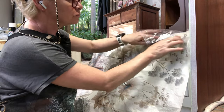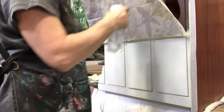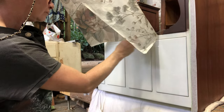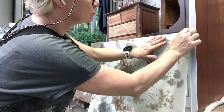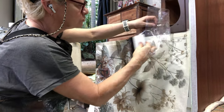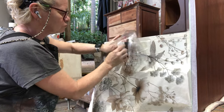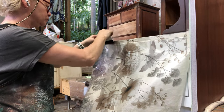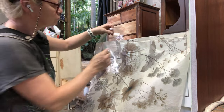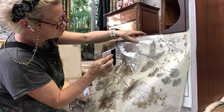In conjunction with the felt applicator and the plastic, and with my fingers pressing into all the edges and corners after I've misted it to create a bit of elasticity, this is the perfect way to manipulate the paper over the drawers. This is a bit of a slow process and you really need to take your time. The video is slightly sped up because the whole putting-on process took close to an hour, but when you take your time with these tools you can get the flat surfaces wrinkle and bubble free.